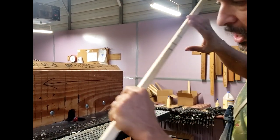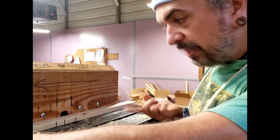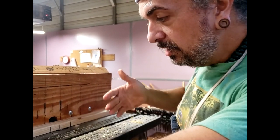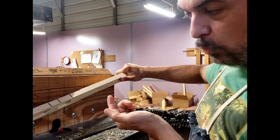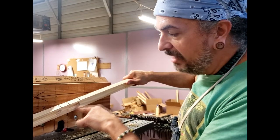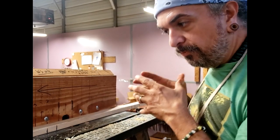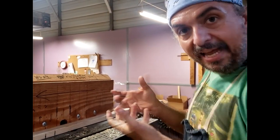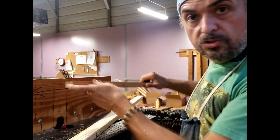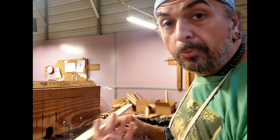When I turn it around and cut the other way, and I've talked about this in some of my other videos, I'm actually cutting wood off of the back side of it with this particular flute, and the tension, because the front side of it is this way a little bit further, it's not actually even touching the blade, only the back side of it is. So the back side has the tension against it, and I'm pushing this way, and that causes it to put force against the wood, and it's not trying to yank it out of my hands. If I were to run just a plain piece of wood through this thing backwards, it would go pew and just go off into the side of my shop and probably hurt me in the process.